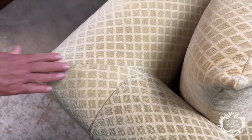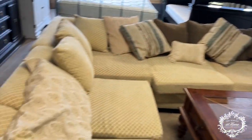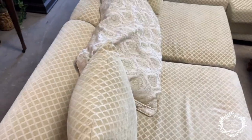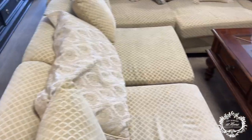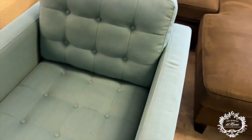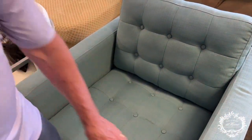Now when we talk about painting fabric — tell us about this fabric, Jean. It's probably a cotton-poly blend with a low nap, so this would paint really well. You've got a sofa you could literally transform. When you're going to be painting fabric like this — not vinyl — you need to make sure you thin your One Step. Thin it down 15 to 20 percent, then sand in between coats, and the final coat is going to be your wax.